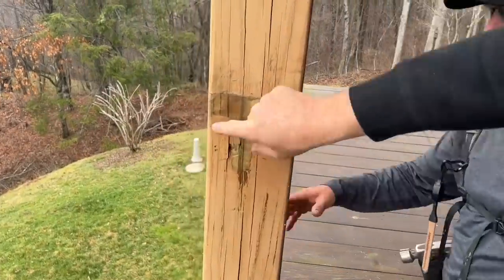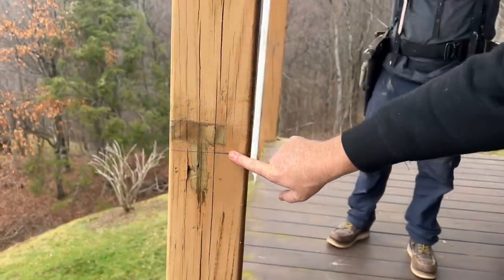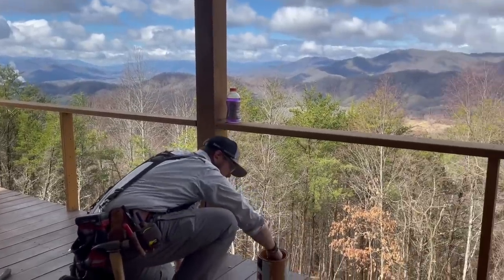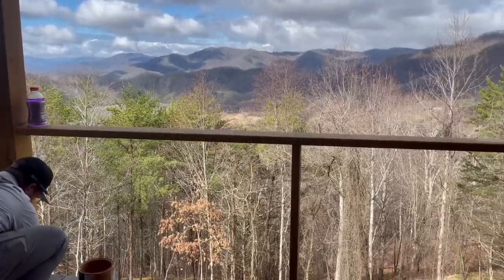You can see how much difference the location of our top cap is going to be than what it was — probably five-eighths of an inch. That's because we pulled from end to end, a straight line. They probably just measured up at each point to get these, and that's not going to look as good with this single top cap — it'll look like rickety road. Around here, a code-passing railing on a residential place like this is 36 inches off the deck to the top of the top cap. For commercial, it'd be 42. That's just a good thing to know if you're going to do something on your own place in the North Carolina area.